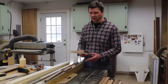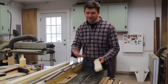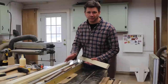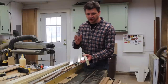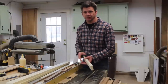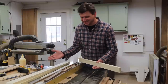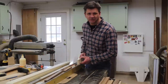I've made bead molding in other videos, but this is the molding that I'll need for an upcoming project so I thought I'd make more bead molding. It's basically the same steps for all of your molding when you're making it with the table saw. You cut the profile into the wood with the cutting head, and then you change back to your table saw blade and cut the molding out of the profile. So let's go ahead and get to work.